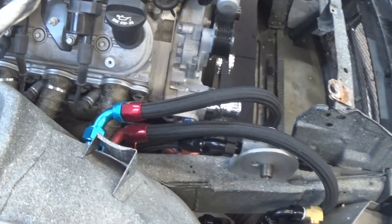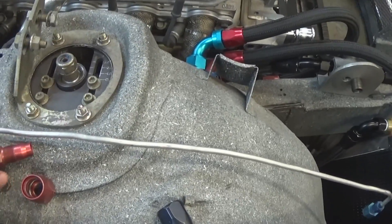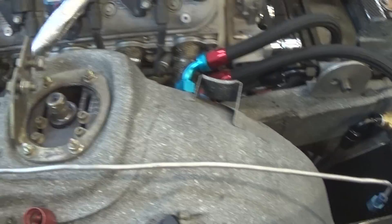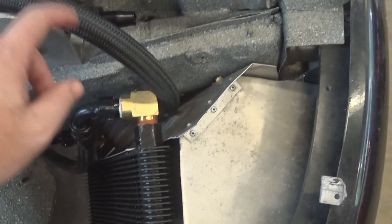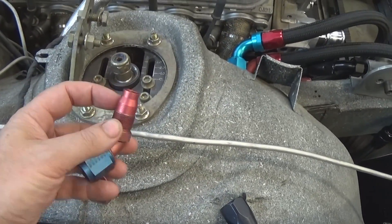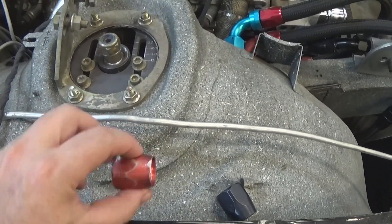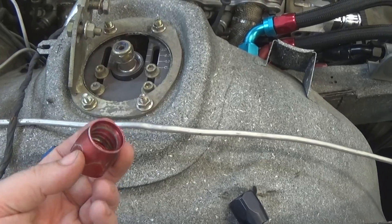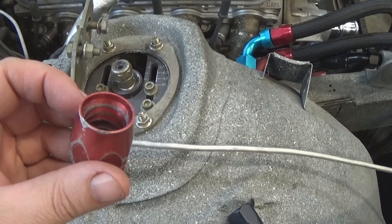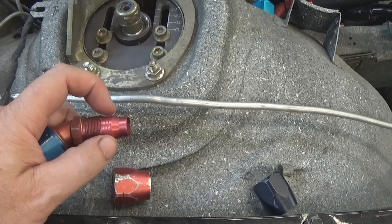Then you get the fittings — there's straight fittings, 90 degree fittings, 45 degree fittings, a whole variety. They have a threaded part that threads onto your nipple, or in this case pipe thread fittings. The other end, the end for the hose, has a taper of some sort and then threads. There's a nut or collar that threads onto it with the hose coming out. If you look inside the nut you'll see ridges that grab the outside of the hose, force the hose up the taper, and as it goes up the taper it makes a tight seal.